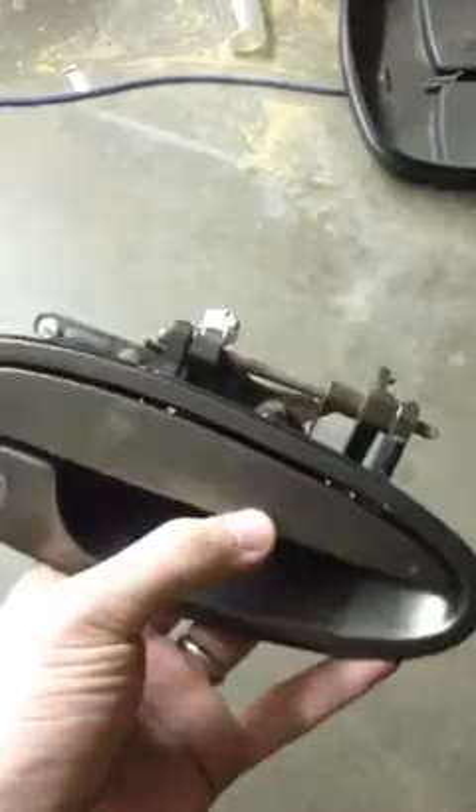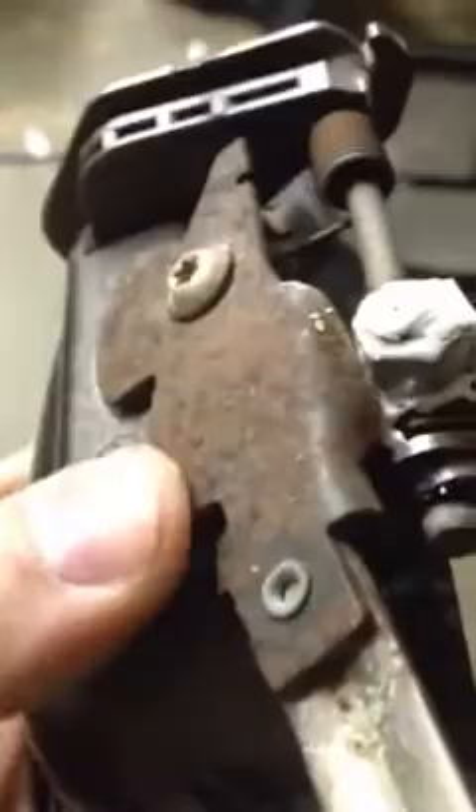The other one I had on hand was for the other side, so what I actually did was drill a little hole here, took a machine screw and screwed it in, and then I took a nut that was bigger than the machine screw just to give me a little more bite on this arm here. Then I covered it in silicone.